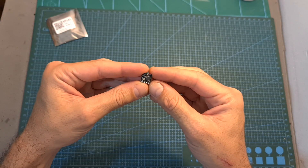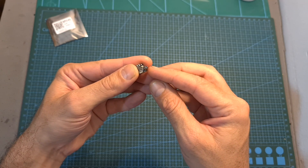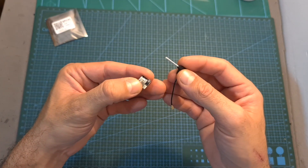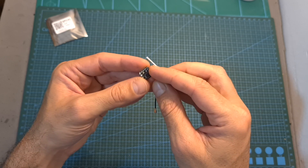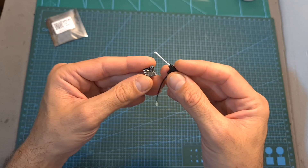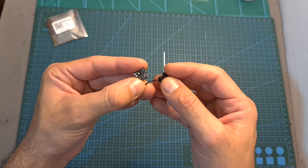This tiny radio receiver is available in two versions. I'm testing the version which comes with the built-in ceramic antenna, and the other version comes with a dipole antenna and features an IPX antenna connector instead of the ceramic antenna. The only difference between the versions is the antenna and its connector. The advantage of using an external antenna is that you'll be able to mount it in different orientations and it should extend the range of the radio receiver.